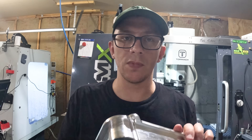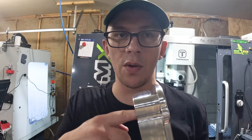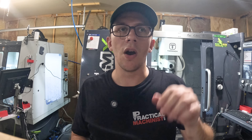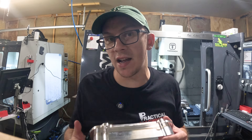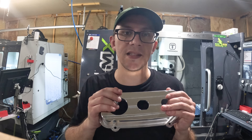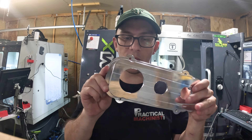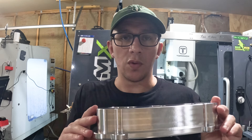So how are we going to fix this? Luckily this is aluminum, nice material to work with, and this customer is very open to saving the product — he doesn't want me to have to remake it all. Lesson number one: always talk to your customer immediately. It doesn't matter what the issue is. Always say, hey, I screwed up, this is what I'm thinking — is this acceptable or not? Let the customer dictate. The customer said we don't need to remake them, we just need to figure out a way that makes sense, that isn't ugly, not a lot of putzing. I thought maybe I can just weld here and recut this feature, but I was worried that weld might not have good penetration and fall out while re-machining. So what we did was a sleeve.